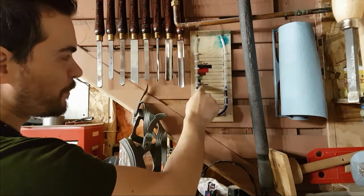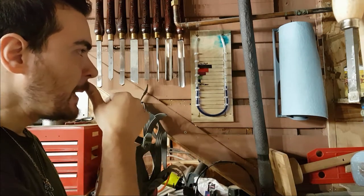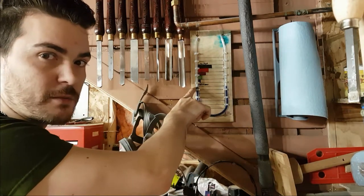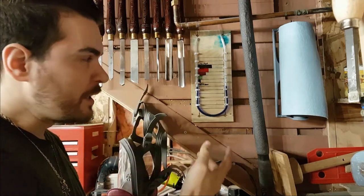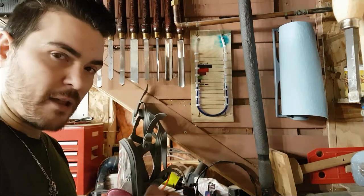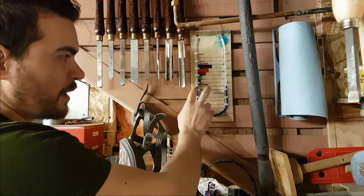I've got five levels from off. When I first installed it — never been turned on before — I unhooked it with nothing else going and the shop air was relatively clean, and I marked off the level point. Once it's turned on, that level will not increase on a fresh filter. Then I completely blocked it off with a plastic garbage bag, and before the bag exploded, that was the top level. So I leveled that off to gradients of 20%, so now I know, based on what level it reaches, how contaminated the filter is. My particular filter has bats — little squeegees — that you can crank around to break up the dust contamination, so once it's up too high I can bat it around and it'll drop down a little bit.